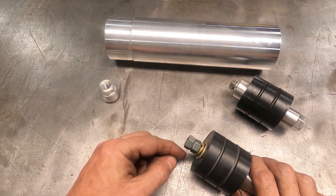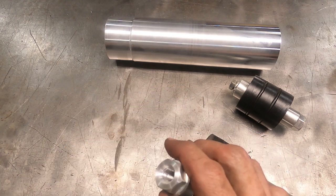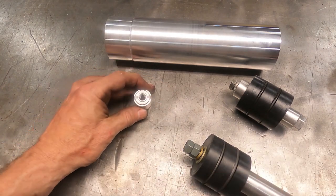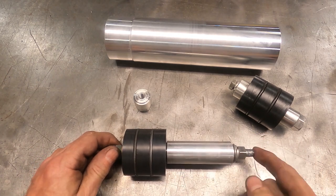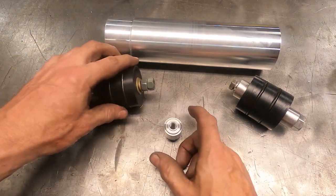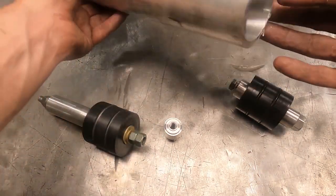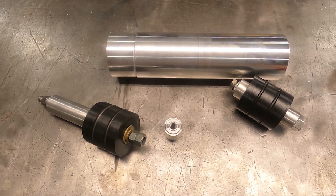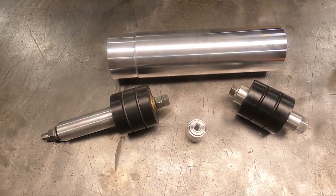This was tested — taking it out of the lathe and putting it back in — and it worked quite well. I might put a flat on the tapered nut or capture a nut on the external side. So far the project works very well, exactly as intended. You can see the finished result here. If you'd like to make one of these I recommend going for it — it lets you access the full exterior while keeping the interiors pristine, and you can cut as many features as you want on the exterior. If you have multiple parts to do, it's very quick to swap over and perform operations on a batch. Thank you for watching!